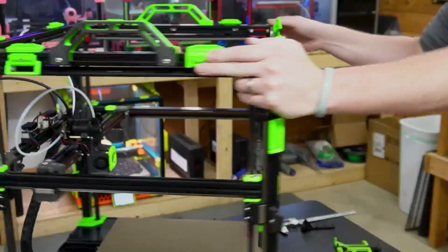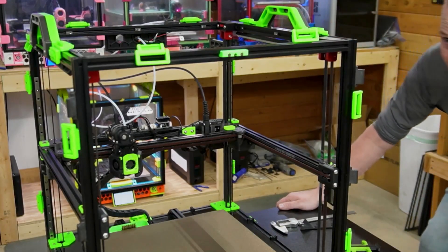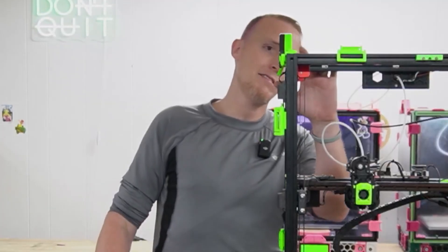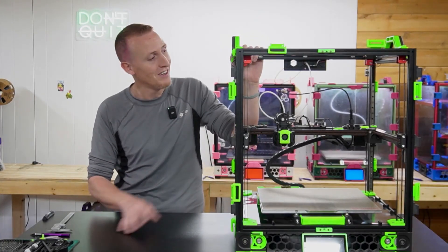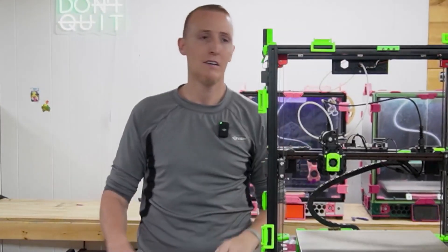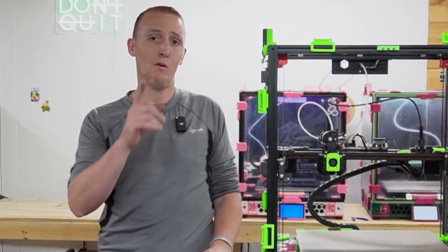All belts should be tensioned the same and the gantry should be moving up and down well. Everything is lined up — just double check all that stuff and that'll do it. Give me a like and subscribe — I've got some really good content coming. I really like these tensioners; they're very solid and sturdy, and the thumb tensioner is very nice since you don't need a tool. I did break a 3D printed one once from too much tension — that won't happen with these CNC parts. For more performance out of your machine, these are the way to go. Thanks to Chaotic Labs for making this video possible — another video is coming for the XY, so stay tuned.